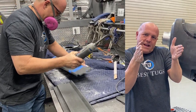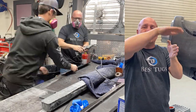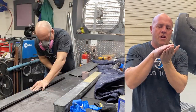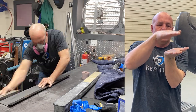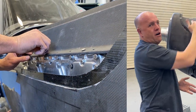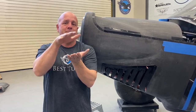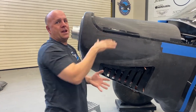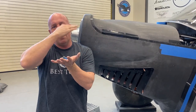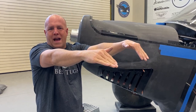That will allow from the side of the cylinder head locker for there to be a straight edge that goes up and then transitions to the exact shape of the upper cowling. And the reason I did that, I want all the air between the top of the cylinders and the pressure plenum as possible. So that's why this has all the contour that matches the cowling. If I just did a typical arch pressure plenum, I wouldn't have this shape in it, and I'd have to keep the whole thing down the depth of these humps. So by making the exact contour, I could push it all the way up and get the most air all the way to the back two cylinders.